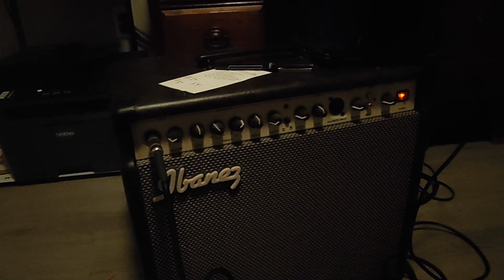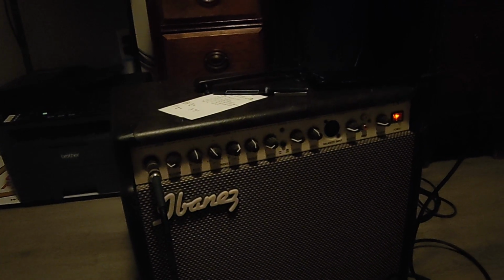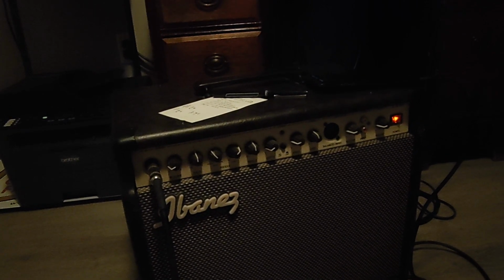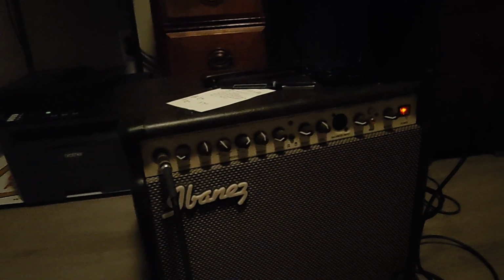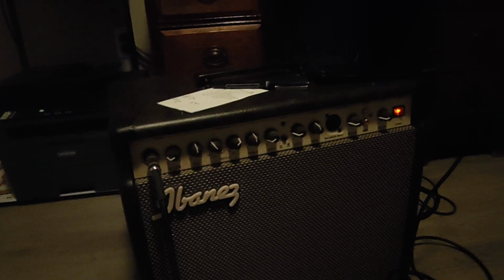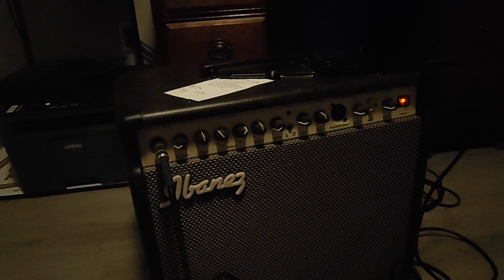This 1/4 inch phono jack or audio jack. Just get the leaf springs on it a little bit tighter, so that there's not so much play. Forgive all the kids in the background. Not so much play, and it doesn't lose connectivity again.